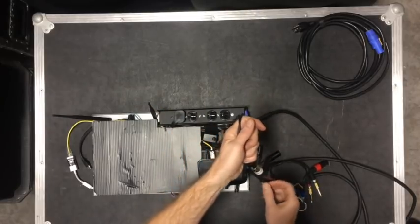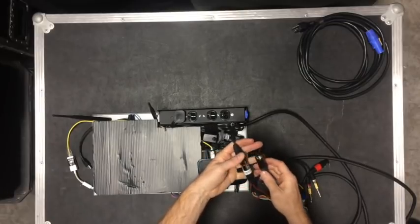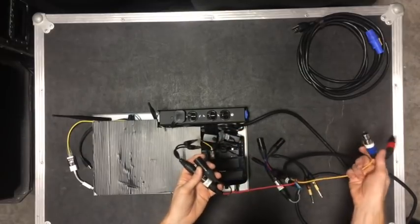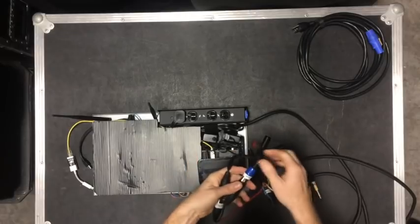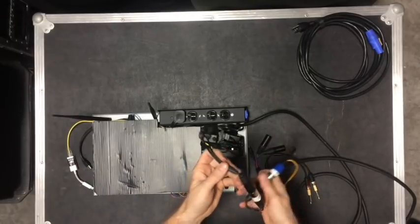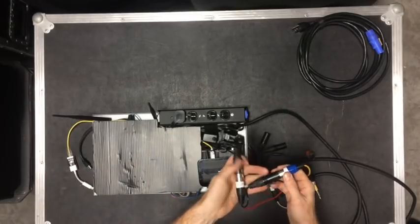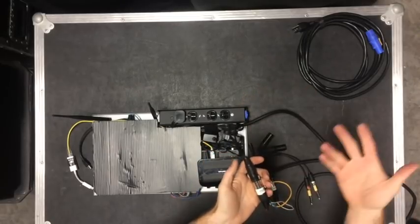So there's output one. You can see here I have an extra little XLR wired to that — that's actually a Y off of pin two so that I can send my reference signal back to the interface. I don't need to pull another pick point off of the mixer. I can just Y off of the output and run this output into the mixer and be able to measure it.